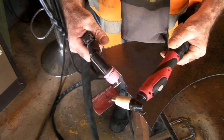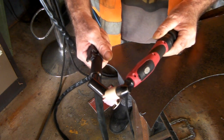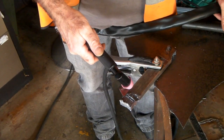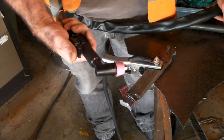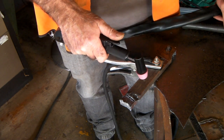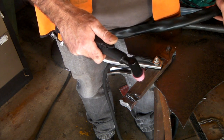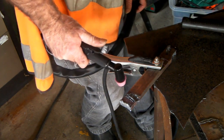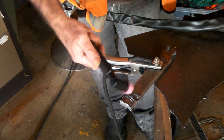So I just use two torches, but I find this AG-60 is actually a little bit better for cutting thicker steel. When I cut the thicker stuff — like this is half-inch — I take the standoff guide off. The reason is you can get closer to your work. That half-a-millimeter gap where the spark has to jump just seems to lose a little bit of power, especially when you're only running 40 or 50 amps — you need everything you can get.